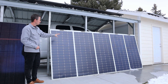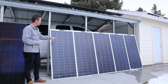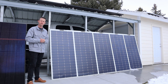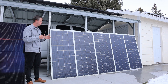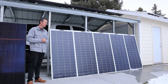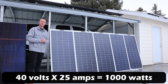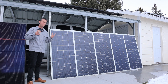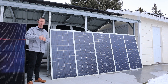You can also use smaller format solar panels — you don't have to use the large ones. I just recommend those because they are so affordable right now. These are the Renogy 200 watt flex panels. I get really good power out of these. I tested four of these in a 2S2P configuration on the Anker F3800 and got around 760 watts — just barely under the rated output. If you wanted to max it out, you could have six of these in a 2S3P configuration. You're going to see around 40 volts at peak power, meaning around 1,000 watts per charge controller, and you'd have to have 12 of these panels.